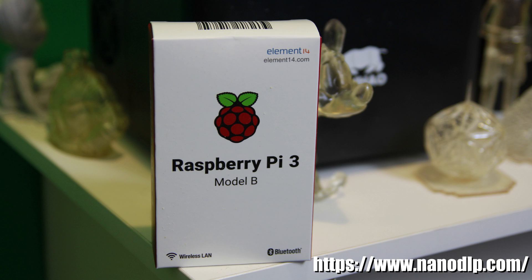The only way around this to get it untethered is to get yourself a Raspberry Pi and install Nano DLP. This will then allow it to run standalone, away from your PC, so you're not tethered. By default, out of the box, you are stuck with it tethered to your PC using a monitor. So even if you're playing games on a different monitor, the aspect ratio on that other monitor may change and screw up prints. A Raspberry Pi 3 is, I think, an essential with this kind of unit.